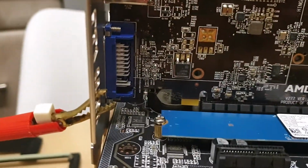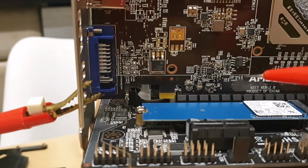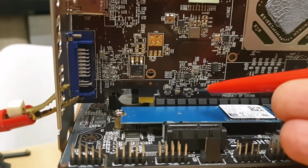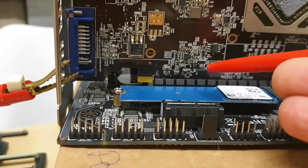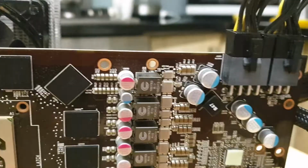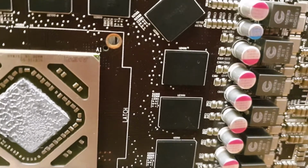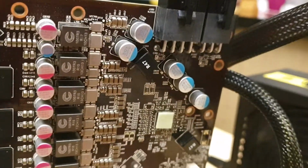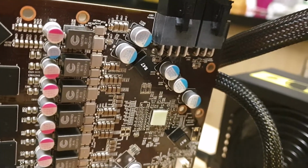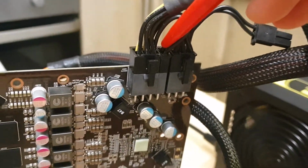basically you got 3.3 volts here, because it's a logical AND, so you got 3.3 VCC. So that way you get power good from 3.3 volts, but you need a power good from these two connectors, and they got the sense pins which are grounded, these middle pins, and this middle pin in the 6-pin connector. Sometimes you need it in 8-pin as well, sometimes not, but this one as well, which is sense additional for the 8-pin connector.